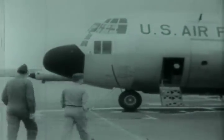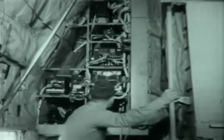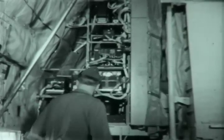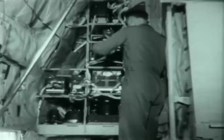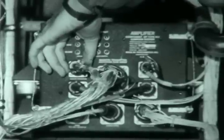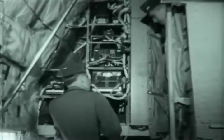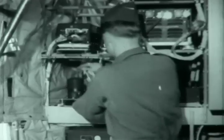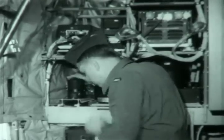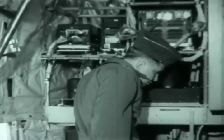The N1 compass system must have a thorough pre-flight check before the aircraft takes off. The first thing to do is to check the cable connections of all units — this will ensure good contact. Check with the pilot for necessary power and allow approximately 15 minutes for warm-up time. Check the slaving control and directional gyro by listening to establish that the motor and gyro are running.